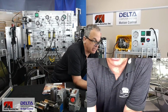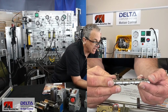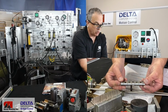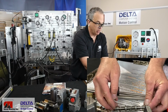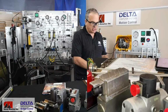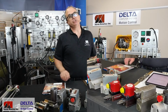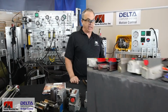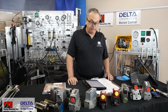And for a lot of valves, it's easily up to 10 hertz, where at 10 hertz you will easily have all the same matching responses, and then perhaps by the time you're at 15, the valve is lagging. Perhaps by the time you're at 20 or 50 hertz, maybe the spool is lagging behind by a quarter of the entire spool's drive travel, and that may be very objectionable. You may have a valve whose response now is not adequate for the reaction timings that are required. So that's the frequency response issue that goes with very carefully designed, tested, refined, and carefully manufactured servo valves. You see those graphs on the specification and application data for different models of valves that you might look at.